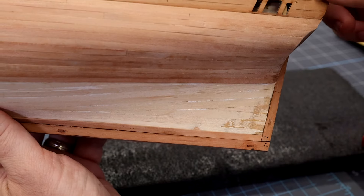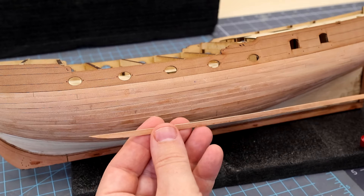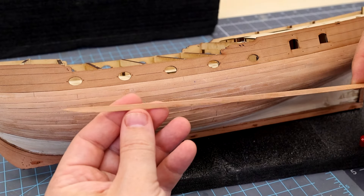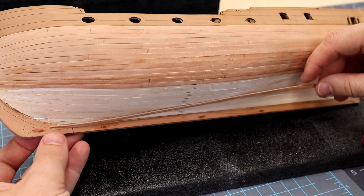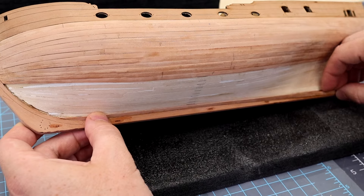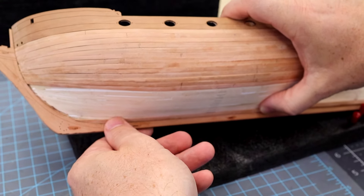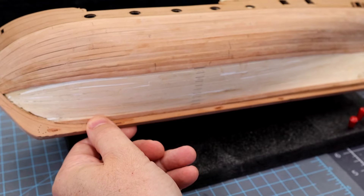This piece is a little bit complicated - it's nice and flat, then has a real serious twist to it, then rolls down into the rabbet, and then you've got to very carefully fashion and curve the point where it terminates into the stem up front. It's a fun piece and really satisfying when you're done. It's really not too hard to create because there's lots of clamping space and room to put your fingers and anchor points. Let me go ahead and figure out what I'm going to do here for this size and we'll get back to you.